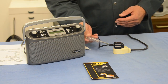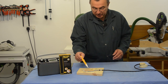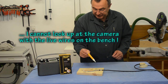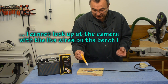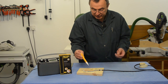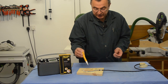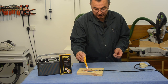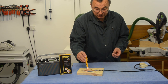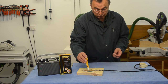And that's something you can't do with one of these gadgets. The fault stick is very versatile — it not only detects a live cable, it will help you search for a break in a cable, identify broken fuses, and check circuit breakers. And if you've got a junction box where you can't see the colours of the wires, this will help you identify which ones are live. That's particularly useful in the UK for lighting circuits where you sometimes get live power going down a blue neutral cable.